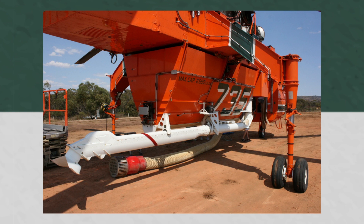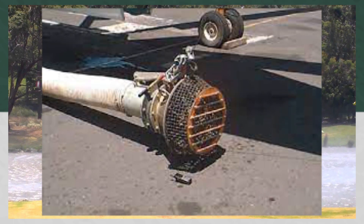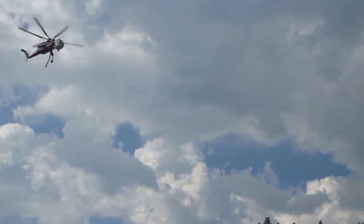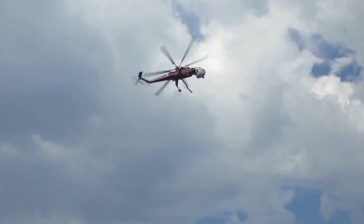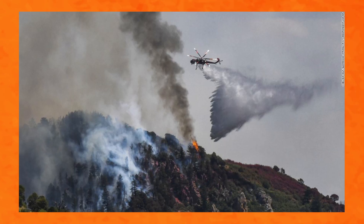The S-64 uses a 9,500 litre or 2,500 gallon firebombing tank with a flexible snorkel that allows the helicopter to self-fill in 38 seconds. This mechanism is driven by an impeller at the bottom of the snorkel that lifts the water into the tank. These helicopters can also be filled on the ground but this isn't common practice due to the delays associated with the need for extra ground support resources. By varying the degree the drop doors open, the crew can regulate the flow of retardant. For fires in grasslands, the crew may go for a drop that covers more square meters but has lower density of retardant. For higher intensity fires with more fuel, they may choose a full drop covering less square meters but with more density. The S-64 can do a full salvo in 2.5 seconds but it's more common to split the drops into four workable loads.